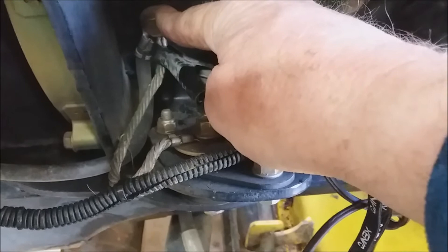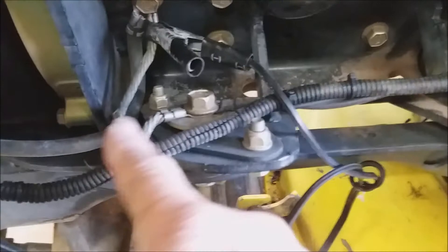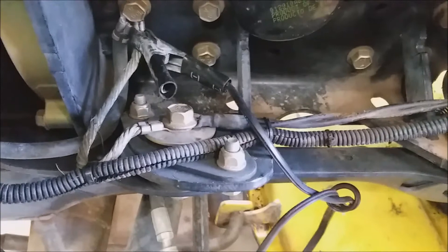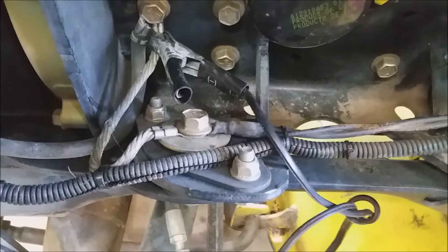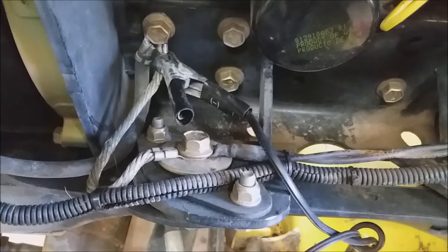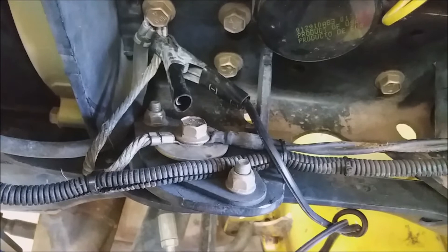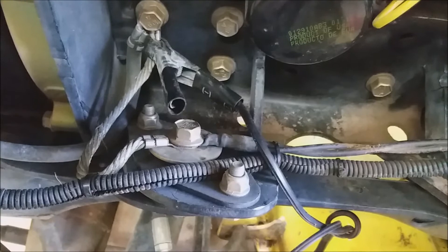From there they ran a stranded cable over and have two black wires connecting under that bolt. Those two black wires are what grounds equipment on the tractor, and this ground also goes back to the instrument cluster. One common problem with instrument clusters is a ground issue. I had an X485 I was working on where I removed that bolt and found those two ring terminals were totally corroded. Terminals can be physically tight with no apparent reason they wouldn't draw current, but corrosion can actually insulate them and cause a problem.